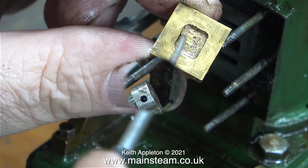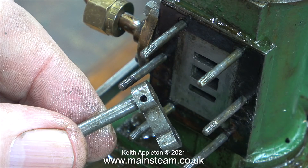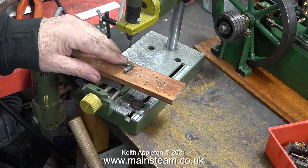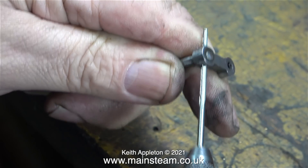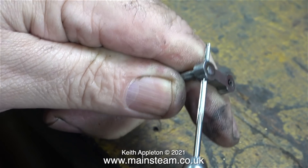This part of the system is not good. The operating arm on the shaft wobbles about because the bolt that originally held it in position had sheared off. To drill out this very small broken bolt, I'm using my very small drilling machine — a Proxxon motor tool drill press, which is a very useful thing to have in the workshop for very fine drilling operations. I do like a belt and braces approach to the job, so once I drilled out the broken bolt, I refitted the arm to the shaft using some Loctite 603, and then I used a taper reamer to ream just about all the way through so I could fit a taper pin.